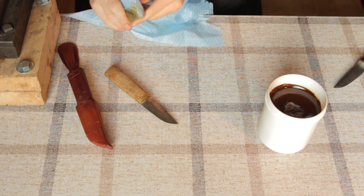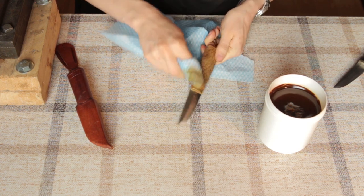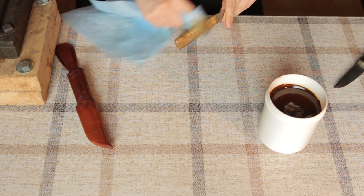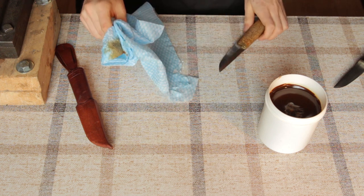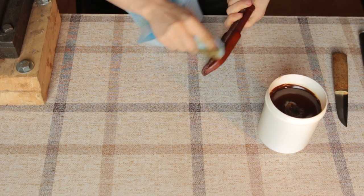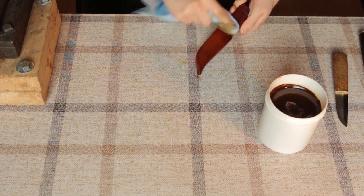The same goes with the curly birch — I'll just wipe it down. If you have a bright wood like curly birch, it's not going to darken it much. Although you have that black tar in there, if you look on the rag it only has a honey color in the end. This handle looks nice and dandy too. Now I'll put some on the sheath — it's really nice, it brings out the color of the leather. The oil will moisturize the leather and the wax will protect it against water from outside.